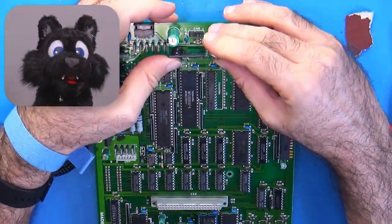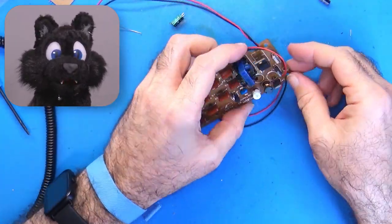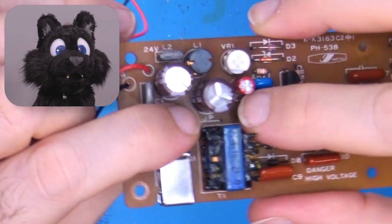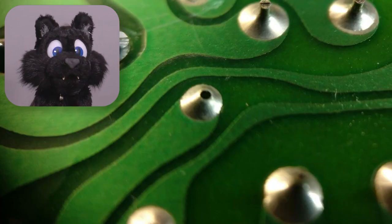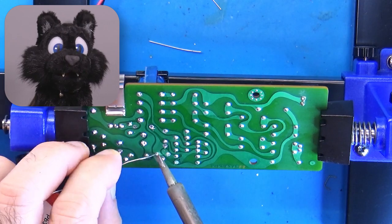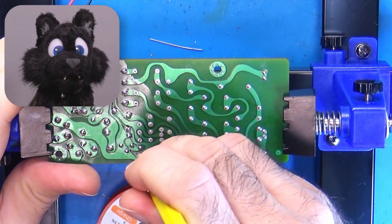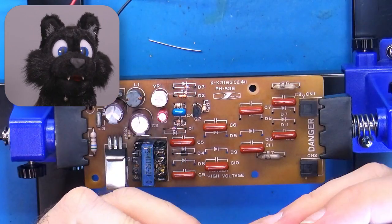Recapping! Looks like these ones on the special board actually truly needed a recapping! There is some liquid gunk underneath and some of the pins around them have quite a bit of corrosion. Let's fix those. Did that wire just fall out on the other end? Yikes! That's a first for me! The corrosion seems to have eaten all the way through between the solder and the wire. Now I'm concerned for all the other joints too! Better reflow them all! And that led me to sanding off every pin and almost every pad on the board before putting the components back.